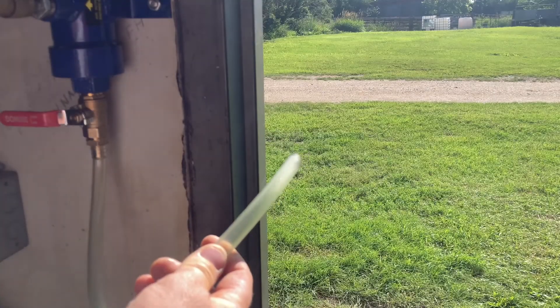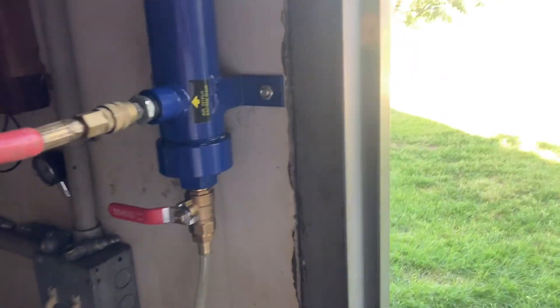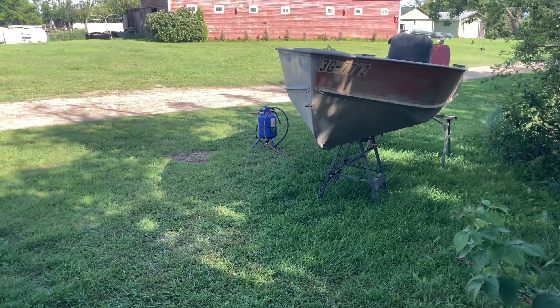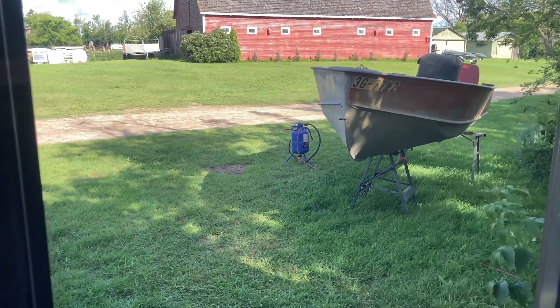At the very bottom here is the water drain, so you can crack this and let out all sorts of water. That helps immensely, because what happens is once you pressurize that water — as you know from your own air compressor — and then you pour it into your sandblaster, that sand and water mixes and it just clumps up, going out in spurts, if at all.